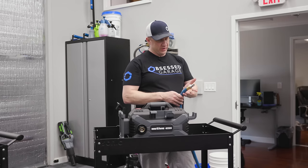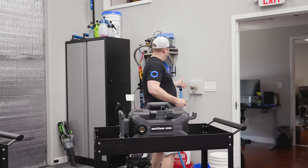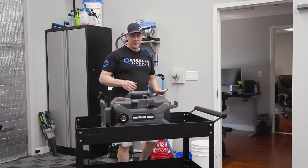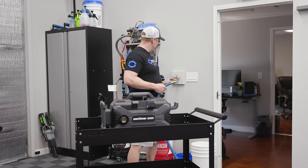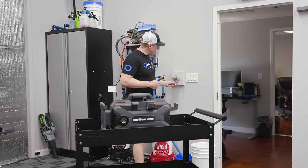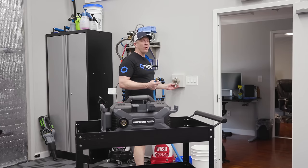And so this is going to be our outlet connection. Now, you'll generally have a threaded post on your hose bib as well, and that's where you're going to put the female side of the coupler. Same thing, there's an O-ring in here. You shouldn't need tape, but we're dealing with water under pressure. You're going to have to work for this.